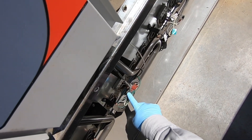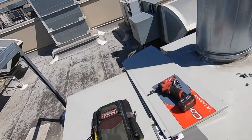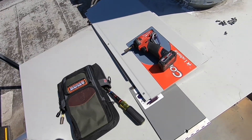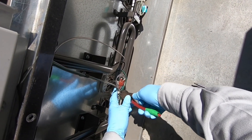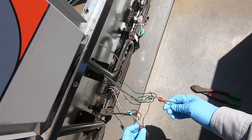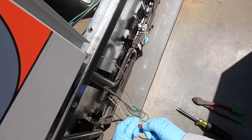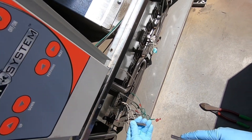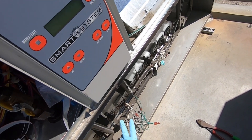So here's our Stage A igniter. Cut this off, take these wires off. Here's your wires right here - connections to the igniter - just want to disconnect these like that. Pull this guy out. Then I will ohm out this one next to a new one so you guys can see the difference in ohm rating, since someone's probably gonna ask that.